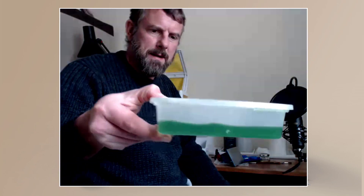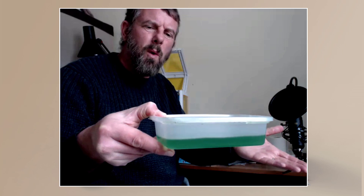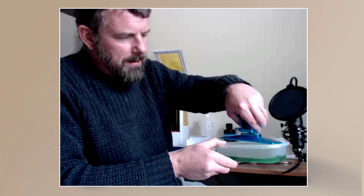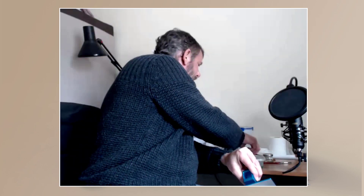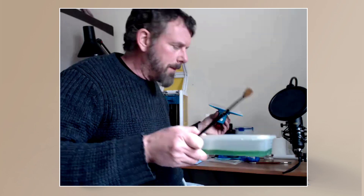One last really handy thing: this little tray with IPA in it — basically a Chinese restaurant takeaway dish. I can open the sealed lid; it's disposable since I've got loads of them. It actually fits the build plate, so I can get the whole build plate into the IPA and use the brush to clean it all off, then remove the model and clean again.